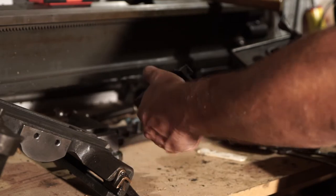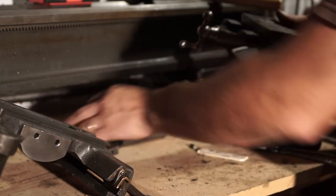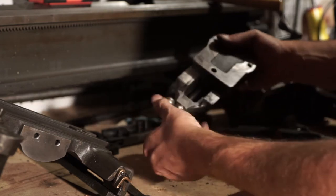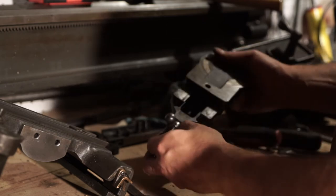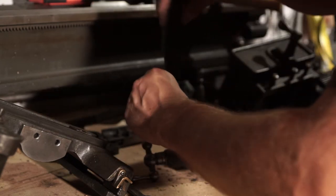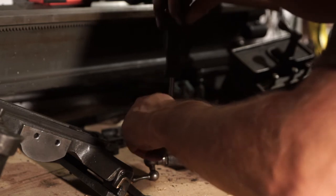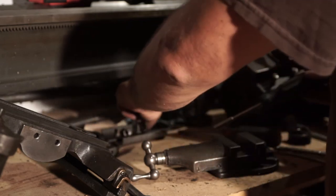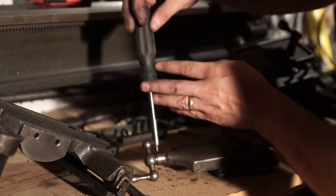Place the keeper jibs. To remove the top of the compound was a bit of a challenge — it seems like one of those impossible puzzles because it can't go in either direction; you can't unscrew it all the way. What I ended up doing was taking out these tiny little screws — two of them. These were tougher to take out, and before you put a screwdriver on these, make sure it's the right size and clean the head out, because I scraped out quite a bit of gunk when I first took it out.